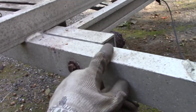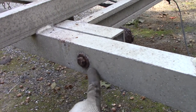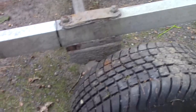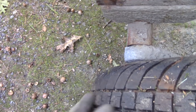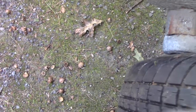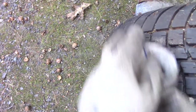I'll get rid of these steel bolts in that spring area and shorten the bolts up. I need to stop it from turning to Alka-Seltzer. I'm also going to raise this axle up - every year it seems like I have to replace these tires. It might be a camber or caster thing, but these tires are brand new from last season and they're already cupped, and there's not many miles on them at all.